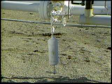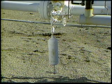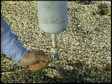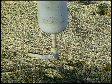All meter tubes should be equipped with a drain line, valve or plug for use during regular station inspections. If liquid is found during regular inspections, then arrangements should be made to drain the tube at regular intervals.